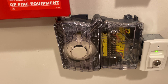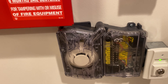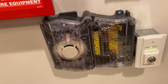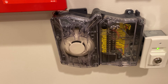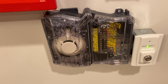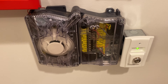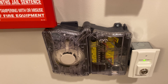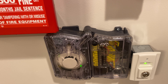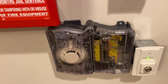It's working under Ohio Revised Code, meaning that when this goes into alarm it'll actually just trigger a supervisory on the panel and shut down an air handler — but I have no air handler to shut down, so it only initiates a non-latching supervisory on the SK5208. I do have a like four-foot sampling tube for this, but I'm trying to figure out a way to cut it down nicely to be able to shoot smoke into it, because it takes a lot to get smoke to reach the detector.